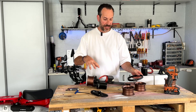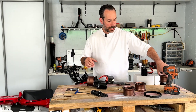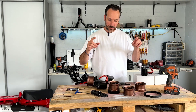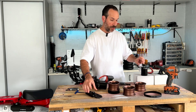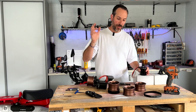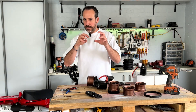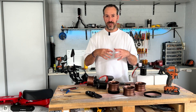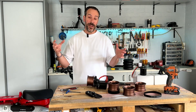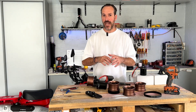The first thing I do prior to getting to this assembly stage is do as much pre-work as possible — all the bearings are in, the wheels, pulleys, spacers, everything's preset, lock tite on all the nuts and bolts and grub screws where possible. I tend to break builds up into mini portions. It can be overwhelming if you have a lot of activities to do in one shot, so break it out into small elements, maybe doing an hour on something a night.